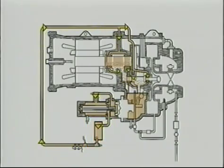The pressurized oil flows to the transmission assembly where it feeds two lines. One line supplies oil to the high-speed thrust-bearing assembly and lubricates the gears. The other line supplies the low-speed shaft bearings. From there, the oil is channeled to the high-speed shaft bearing nearest the pinion. The oil then drains to a sump at the base of the compressor housing.